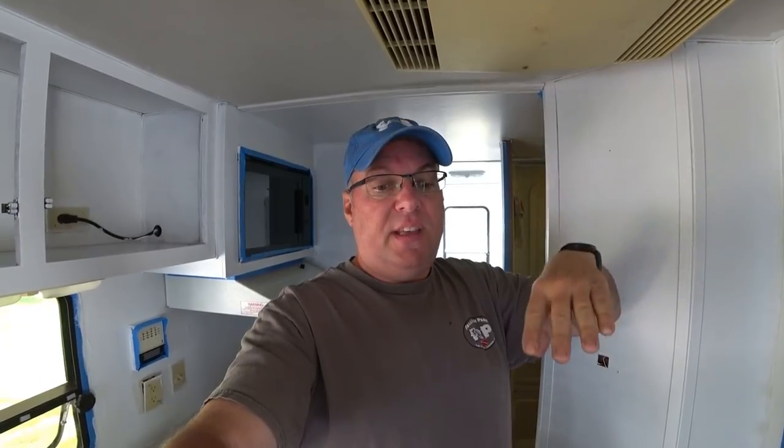The way hydrogen gas works is that it's lighter than air. So if they do need to vent and release hydrogen, it's going to float like helium would. So whenever you do any kind of a tube going out, you have to make sure that it's about 6 inches above the battery box that you make for these things to vent. Or you need to put some sort of a hood system on it, so if they do vent, it goes up into the collection area and out of the tube.